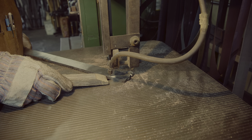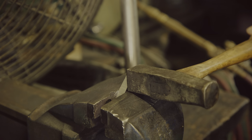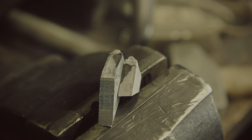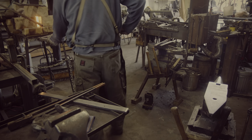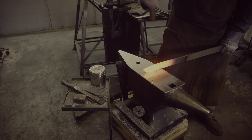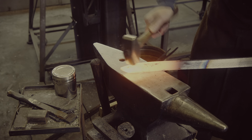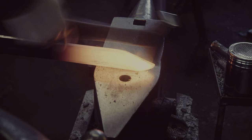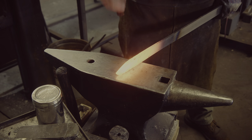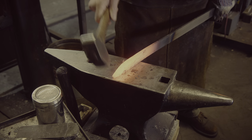The reverse tip method has its own challenges. Forging back the tip is very hard on the welds, so this is also a good test to validate that the welds are solid. I will also test the cutoff piece to verify the welds — the shiny parts were welded and the dark parts were not. This is not a cause of concern though, because I already knew that there was a gap close to the tack weld that I would not close up. I am forging the tip very lightly. This creates a lot of stress on the welds and I really don't want them to open back up.